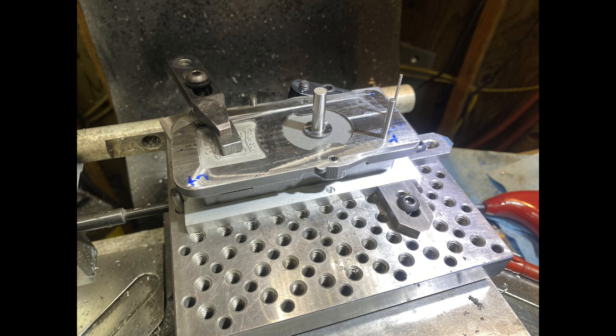Here I've turned the vice over on the pallet and the quarter-inch dowel locates it. The two pins on the right — one is for the fixed jaw that goes down, which I've already drilled, and then there are small holes you can see on the left — these are for the keyways that get milled into the bottom of the vice. I'm making sure everything's aligned and then I was going to machine the slots for the keyways. Actually I had a failure here, which I'll discuss.